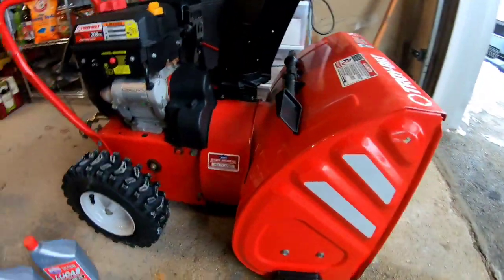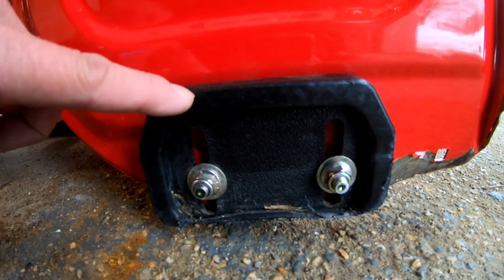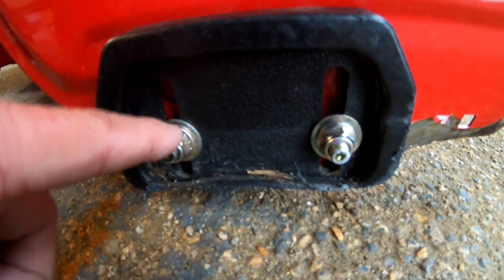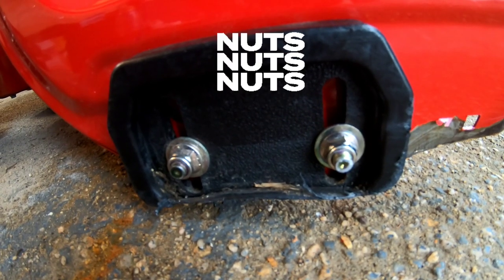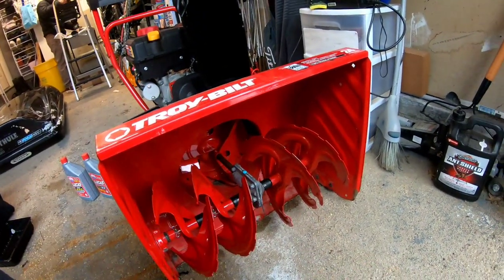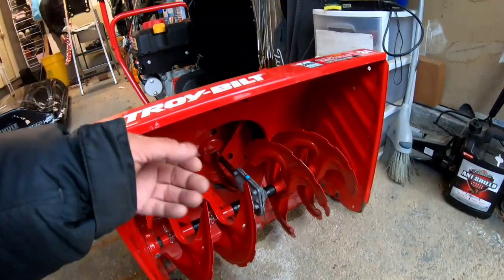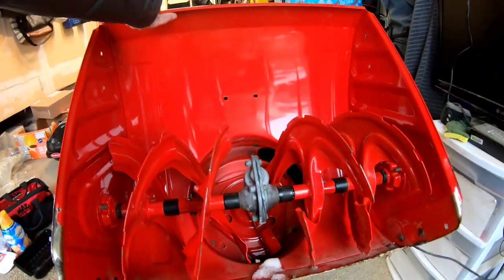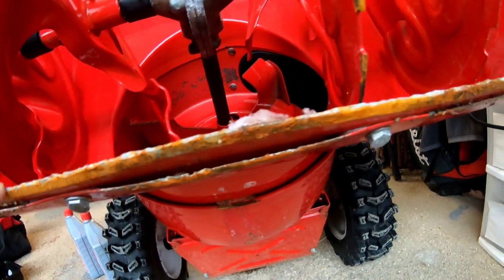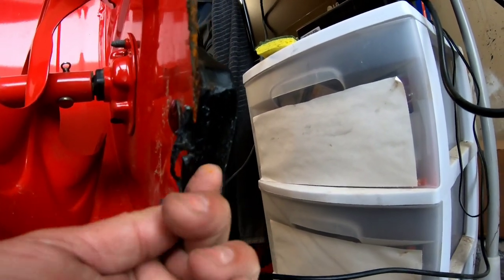Also what we're going to address today are these skid shoes. As you look at the skid shoes, they're made out of plastic, and the top part is nice and new because it's never been used, but the bottom part is all scraped up. So we're going to loosen these — they look like half-inch bolts — and just flip them upside down. We noticed in the Winter Storm 2021 part three cleanup video that when he went over some of the sidewalks where they have a ridge for the drainage of the water on the concrete, it went boom boom. I'm assuming the bottom scraper bar is all scraped up, and as you can see it is slightly scraped up with some rust buildup, but it's not too bad. The skid shoes are done.